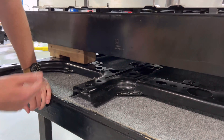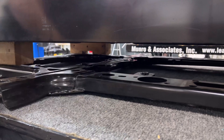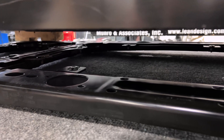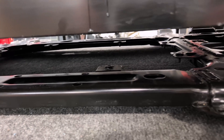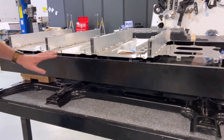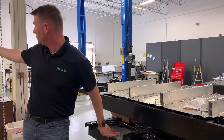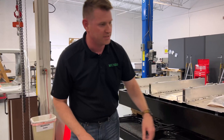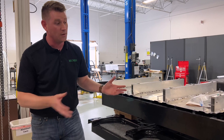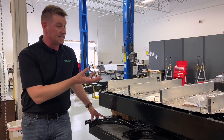Not visible here is a whole series of skid plates that cover the inner portion of the ladder assembly, but you can see those mounting brackets. We feel there's a lot of opportunity within this particular ladder frame as well, specifically as the volume of the Lightning has increased from around 40,000 units to roughly 150,000 units. Given its reception and being essentially sold out, Ford may be motivated to simplify this more — perhaps with some hydroforming, like they do with the front-end structure, which gets rid of a lot of welding operations. It's a little more expensive on the capital side, but there is opportunity for complex shapes, part reduction, and welding operation reduction in this frame.